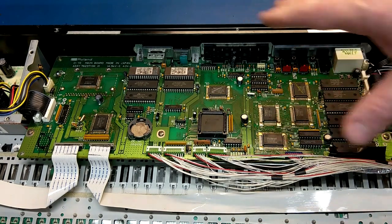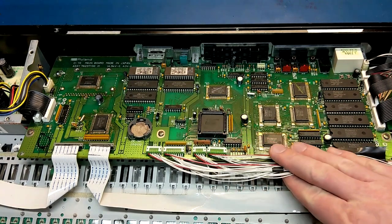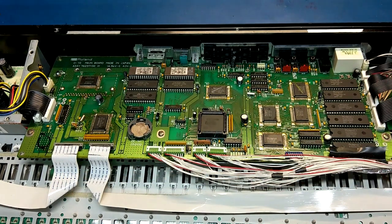The LCD and the front control panel are buried under everything here, and I believe this is the HV supply for that actual LCD backlight. I might be able to replace that backlight even if I can't source the LCD itself. The LCD still works, it just doesn't look as nice as I would like. These cables here go off to the analog board, and then these two ribbon cables go to the actual keyboard itself, which looks like it comes out pretty simply — shouldn't be as much to tear down as there was in the JV80.